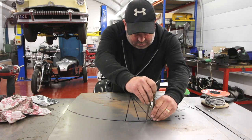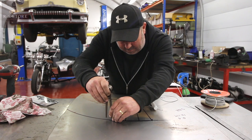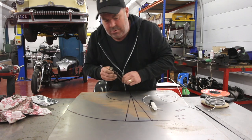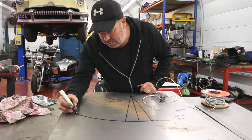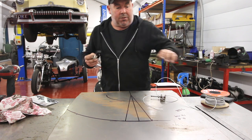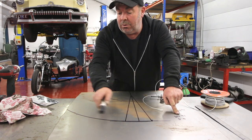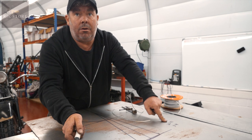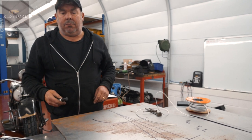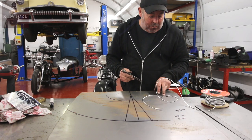So, 1, 2, 3, 4, 5, 6, 7, 8, 9, 10, 11, 12, 13, 14. Why separate out 14? Because you times your distance there by pi. Yeah. That gives you 14.1. So that is the circumference of your cone when it's rolled. Oh, okay. All measurements in pi are to do with radius, diameter and circumference. I'm not a mathematician by any way or form, as you can see. So we want 4.7 inches.